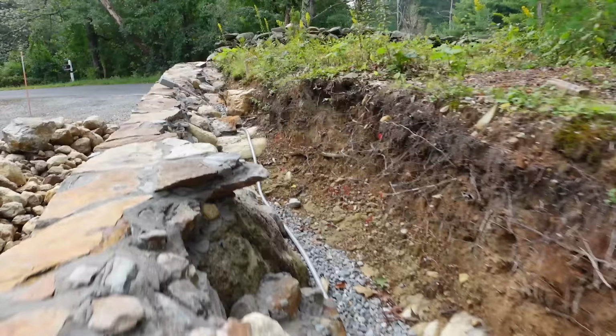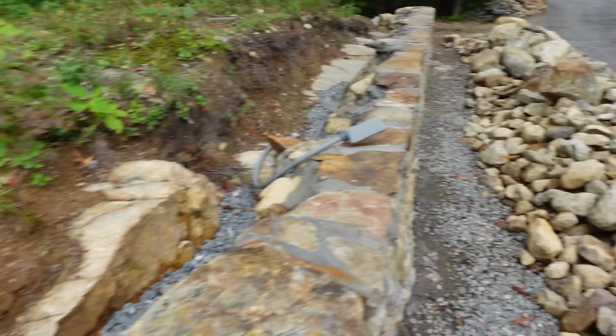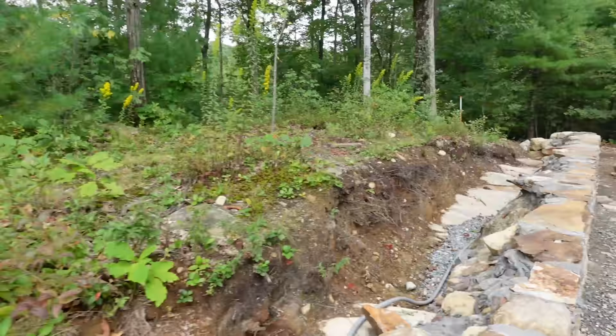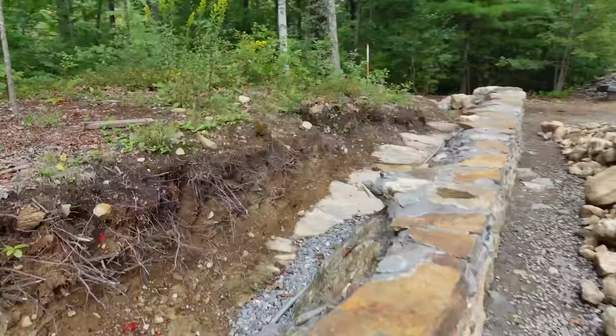And then I got extra because it'll be easy to cut back, but the point of the extra is gets me pretty much all the way down to the end of what I've got exposed. It's easy to bury the wire now than wait and do it later. But what I'll probably do is put a post same distance down the driveway as the post light, something with a sign, something with a light, maybe something with a flag, haven't decided yet, but I will probably put a concrete base back here with a sleeve for a 4x4 post and decide later.